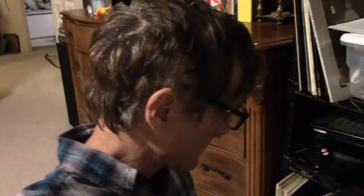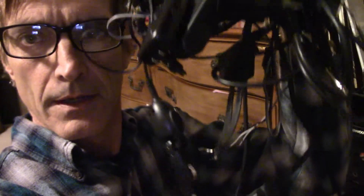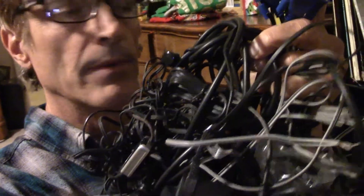If you look in your assortment of transformers, look on the label and look on the charger part, the transformer part, and find one that has the right voltage, which in this case is 3.7. Find a plug that'll fit it — in this case I found this one. It came off of something else, I cut it off, see if it fits.